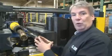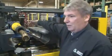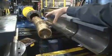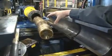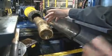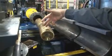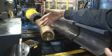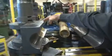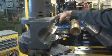In some cases, if you're bending something thin wall or tighter radius, there are three additional pieces of tooling you may need. You may need a mandrel to go inside the tube to keep the tube round as you're bending it. In this case you can see quite a few balls on the mandrel because we're bending four-and-a-half-inch thin wall tubing. The number of balls is determined by the radius you're bending and the wall thickness. You may also need a wiper die, which is normally needed when bending tight, thin wall, to prevent ripples in the tube.